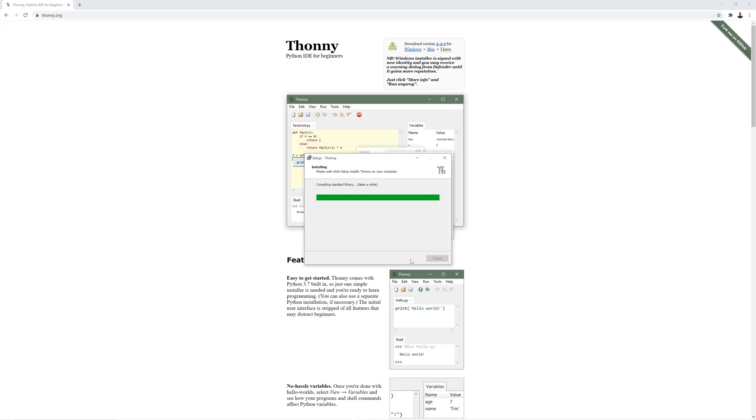To begin with, we need to set up the Raspberry Pi Pico, and to do this we need a program called Thonny. You can get it from the website address shown, and once it's downloaded and installed you use it to write MicroPython code to run a program on the Pico once it's powered on.